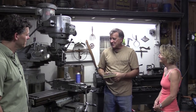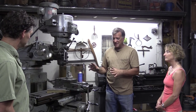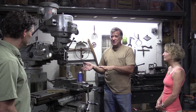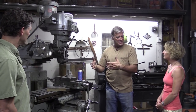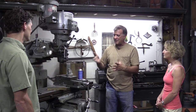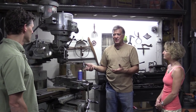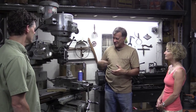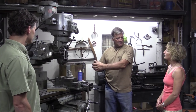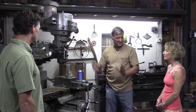Makes my job a lot easier — it really does. There's a lot of setup. The gentleman who showed me how to run this machine was very specific about that. About 75% of the time you actually use the machine is spent simply getting it clamped down, lined up straight, getting everything lined up the way it's supposed to be. You make your cut, drill your hole, make your slot — whatever you're doing — then clean up all that mess and reset it up for the next thing. That's why the new computer-controlled ones are so much better: you can tell it do this step, now do that step, and they'll even feed their own end mills — a little arm takes one out, puts a different one in to go do the next step. They're amazing to watch.